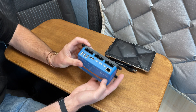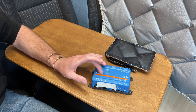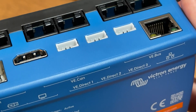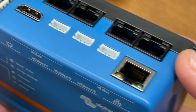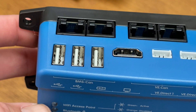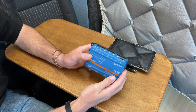So let's look at the hardware and what you get with the unit. Whilst the majority of Victron equipment like the BMV and the MPPT have Bluetooth, they don't connect to the Cerbo via Bluetooth — most units don't. There are a variety of different ways to connect: VE Bus is what the MultiPlus uses, VE Direct is for things like the MPPT and Victron shunts, and you can also use VE Direct to USB cables, which is what I do with the Raspberry Pi. Most different bits of equipment will attach to the Cerbo in one way or another.